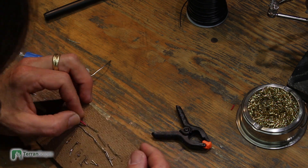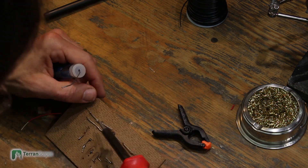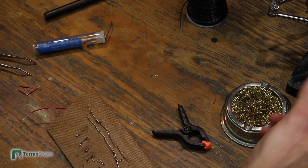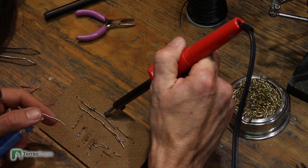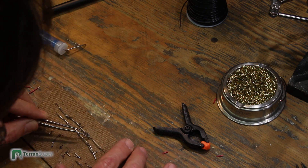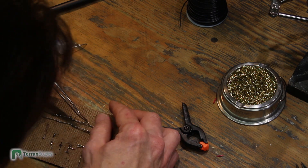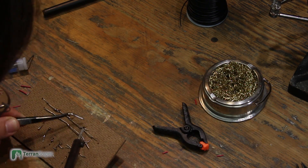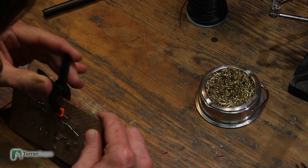My soldering skills are starting to get a little bit better. I actually learned about tinning the tip — here's a tip I wouldn't talk about electronics, but how can I not. I never quite understood what tinning your soldering iron meant, so I did a little research and found a great video where you basically wrap your whole soldering iron tip in solder, cook that all off, and it leaves a very nice layer of solder on the iron which really helps transfer the heat. With each of these projects I'm getting a little bit better.